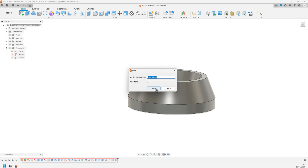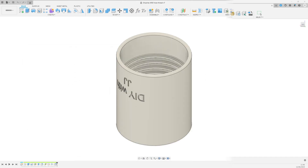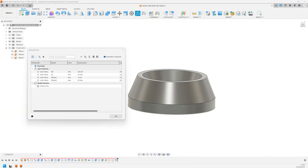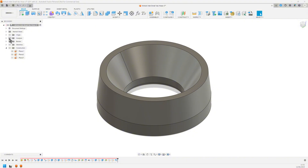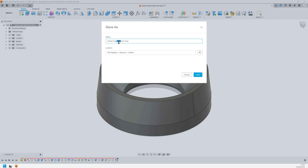Save the file and export it if you care to. Now I'm going to show you the power of parameters. Remember the thread we made for the large shop vac hoses? The outside diameter on that one was 57 mm and the inside diameter was 51.5 mm. Because I used parameters, all I have to do is change those values. I will use 50 mm for the inside to get an edge for the hose. Here's a section view of the new part. Select Save As and change the name from small to large inlet. Now you have both inlet ends and it's time for assembly — look for my next video for that. Thank you for watching. I hope it may have helped you in some way.